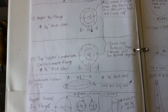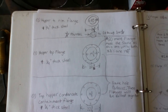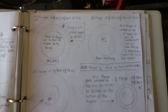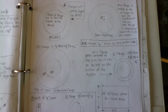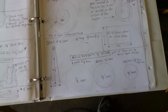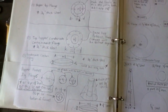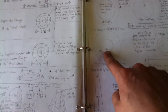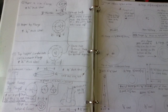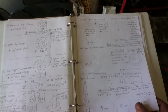A lot of this stuff is just custom for this build to fit inside that vessel, which was an industrial air compressor tank I got at the junkyard for about ten dollars. While I'm talking I'll slowly pan across these notes. All the flange numbers and dimensions and thicknesses are here. The two quarter-inch steel plates are for the crane assembly at the top. This ring is going to be welded — that's the hopper and the condensate lid — so you can see how I'm going to bend that ring to capture condensation from the wood.